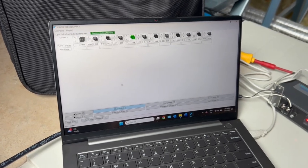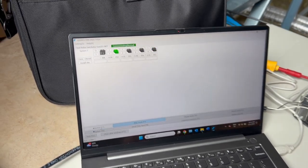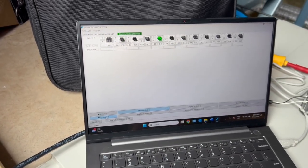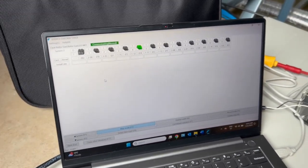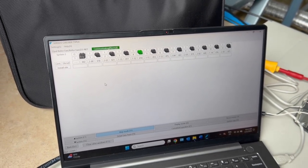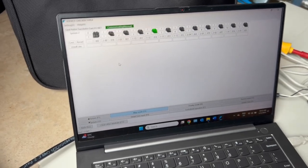We're looking a lot better now. The one thing I didn't pick up on before - for whatever reason this was the only system that was popping up, 006. I'm fairly confident the air net address of the one that I'm working on is 002, and that would also line up with the group address that I saw listed on the centralized controller as well. I just didn't notice it before - we'll quickly go double-check.